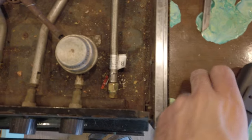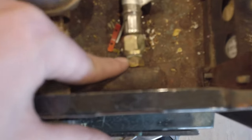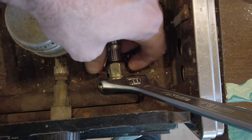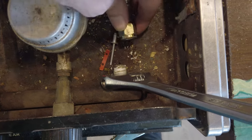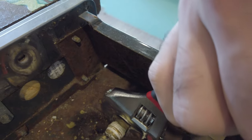So here is the culprit in question. So right in there, when I would spray it, there would be a tiny little bubble that would come out. So we're gonna try and get that gas manifold out over to a pipe worker or some kind of metal worker, and we'll get a new end welded on that we can connect up that does not leak. Problem solved.